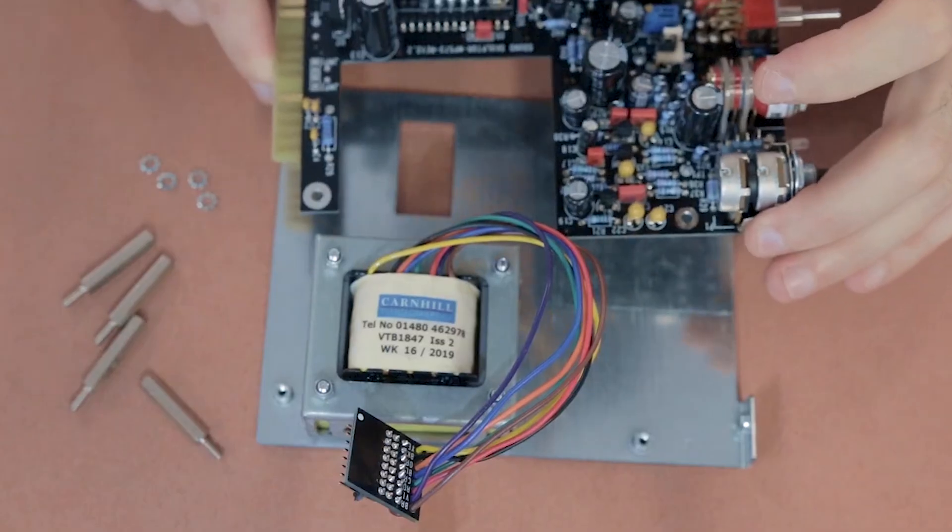Not sure if you're aware of that, but that is actually available. As far as a real Neve sound goes, the SoundSculptor preamp is actually excellent. I've used real Neve preamps and real Neve EQs in different studios, and I can tell you these things are the real deal. They have that sound, that sheen to the top end, that nice warm bottom end. They have real input and output transformers from Carnhill, and proper inductors in the EQs. The high frequency shelf EQ is a slight caveat — it doesn't use an inductor — but I actually prefer what SoundSculptor offer there.